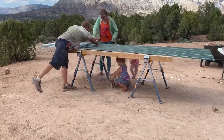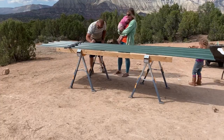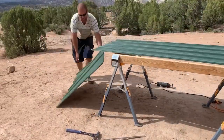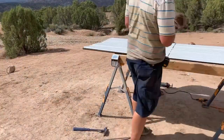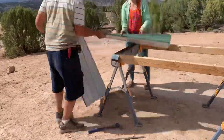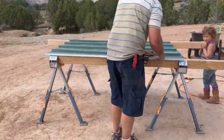We need to cut down our metal roofing. To do that we're going to score the metal, bend it, and hopefully it should snap off. Now we did have to purchase this metal roofing — we got it from Home Depot, it was about $30 for this sheet. It matches what we used on the chicken coop, which fortunately was given to us, but I used all of that on that project.